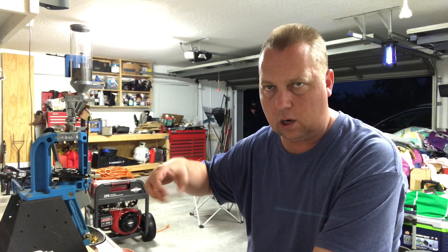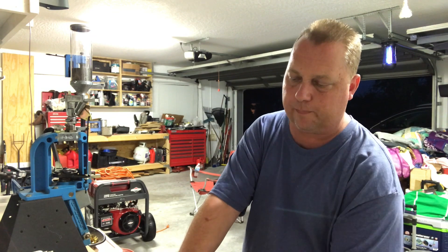My old generator had a different plug, so of course I had a different cable. And now I've got to get my cable situation figured out such that the next time the power goes out, I can easily get the generator up and running and plug it into my power inlet on the wall by the power panel. So I bought one cable on Amazon — I'll show you that here in just a second. And I was trying to figure out how to interface it. The problem is I've got a 30 amp output on the generator, which is a four-prong twist-lock connector — that's kind of standard for a 30 amp generator. But my wall outlet is actually a 50 amp input.